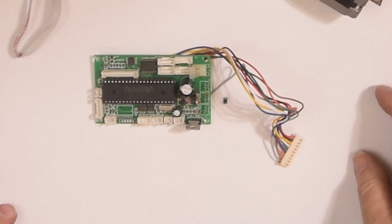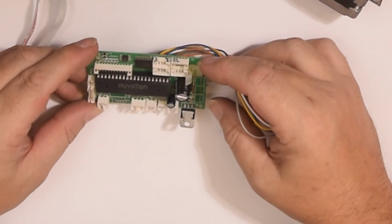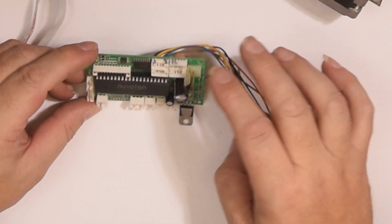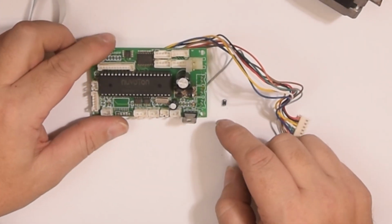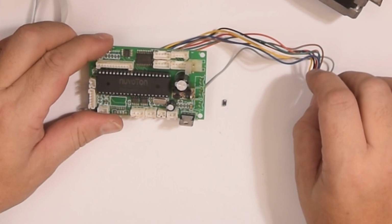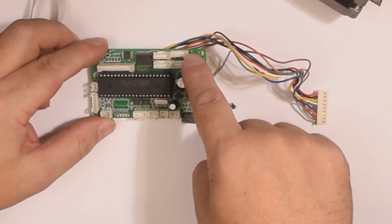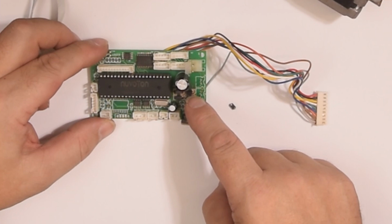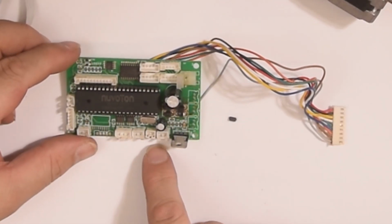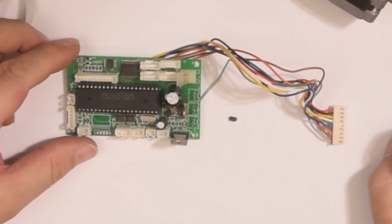Here we have, on this bit of paper, the first controller board. Now, I've already spent quite a while taking all of that Evo-Stik glue off of all of the connector sockets, and it's looking a lot tidier. That's one of the diodes that's come off. But first of all, this is the AC input terminal. This one feeds the 4 diodes in bridge rectifier configuration. I've gone through and taken some high-res photos. As I say, let's go through it in more detail and explain what each part of this board does.